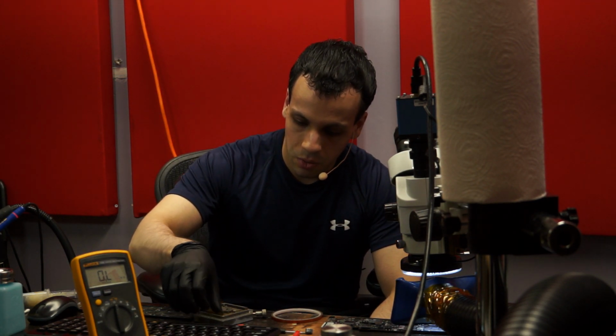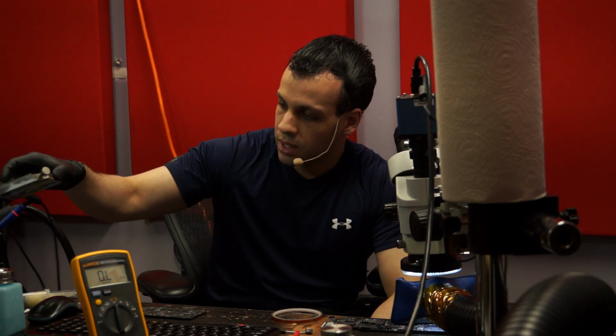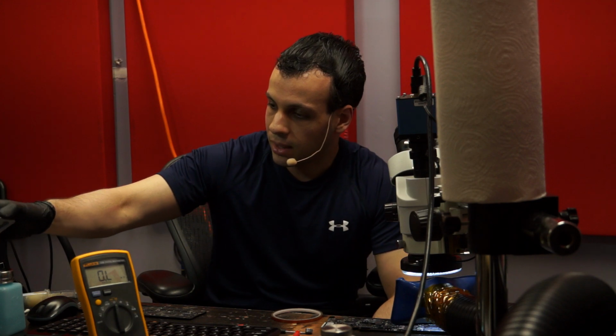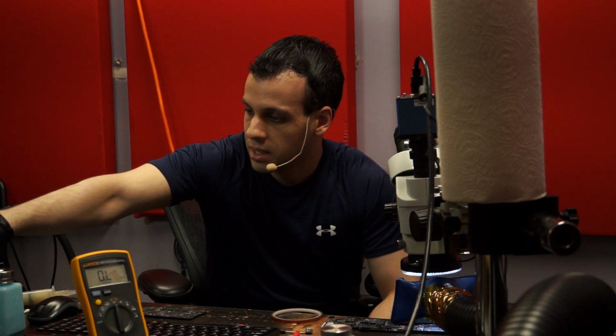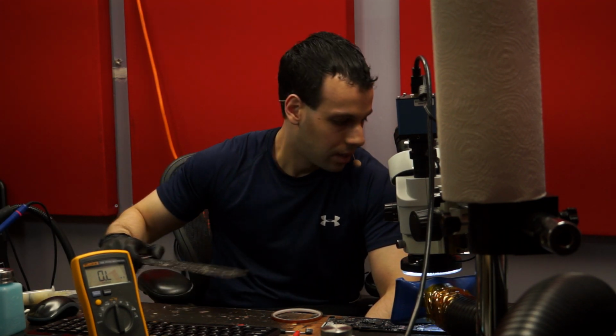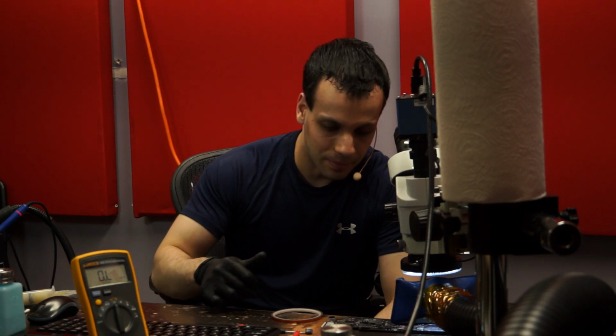So, what was wrong with this board? We had missing SMC reset L, and that, as always, was not the actual chip that creates SMC reset L causing it, even though I always assume it's the chip causing it. And it was yet again the SMC.